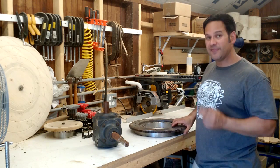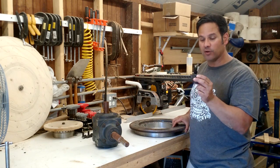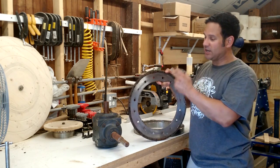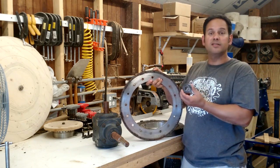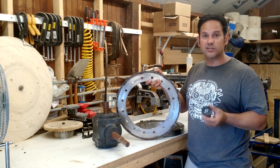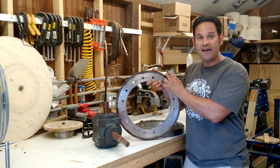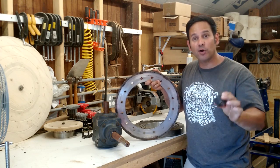What's interesting though is the gear reduction. This is a one-to-one gearbox — there is no reduction on this box. However, this is a 24-tooth gear. I've already taken the liberty of counting all these teeth — it's 196 teeth. The way you determine gear reduction is by counting the teeth and dividing them. So 196 divided by 24 gives me an 8.16 ratio, or rounding up, 8.2 ratio. If I have a 1725 RPM motor connected to this gearbox, my plate is going to be moving at about 210 RPM, which is perfect for what I want.